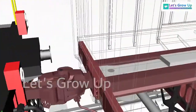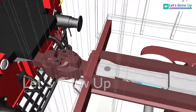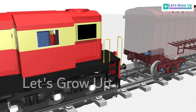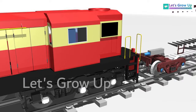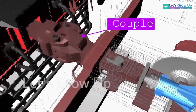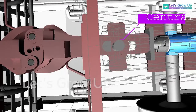A draw gear, also known as a draft gear, is the assembly behind the coupling at each end of the wagon, to take care of the compression and tension forces between the wagons of trains. In this video, we will learn the CBC draft gear and its working. The coupling action between wagons is automatic. The draw bar is cast together with the coupler head. The tail end of the draw bar is connected to the draft gear through a central pin.